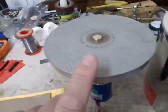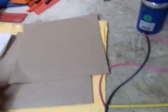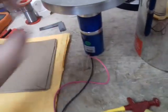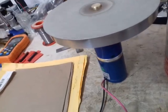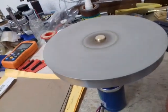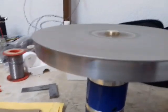That's going to be the same system on the other one I'm making now. These discs are relatively cheap to buy — you can go right up from 120 grit all the way up to about 6,000. I've got a selection of them here, and that's the cheaper option, cheaper way to go than buying the expensive impregnated discs which are like hundreds of pounds each. I'll turn this machine on and you can see the speed that it goes. With it being variable voltage on the desktop supply I can speed up and slow it down at any speed I like. At maximum voltage at 24 volts you can see how nice and steady it is.